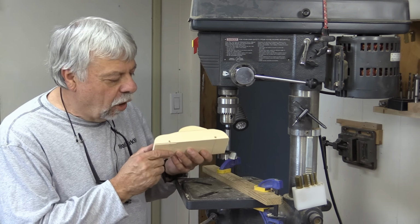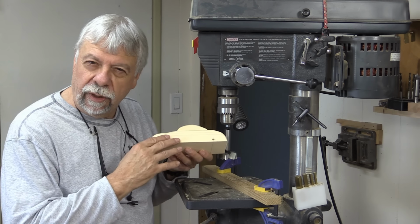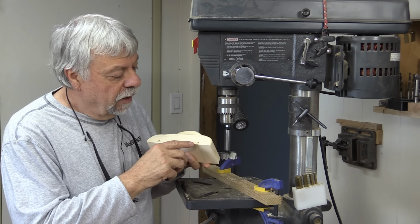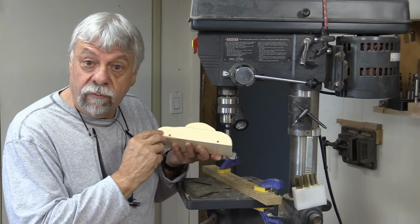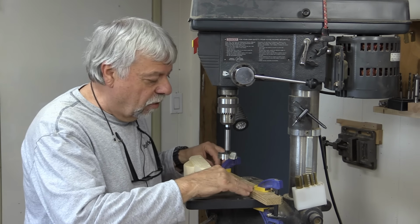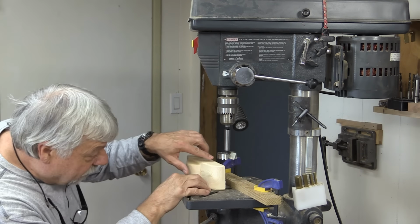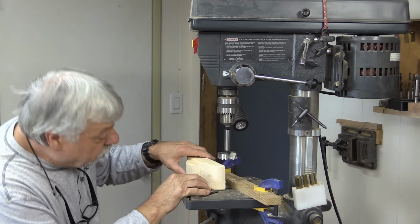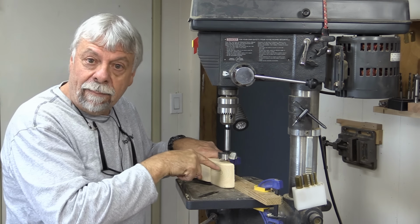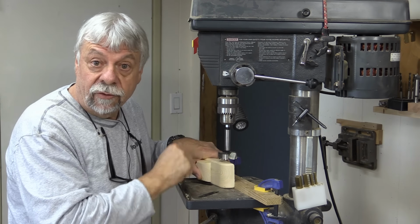There's our modified car, and in this one we're going to be cutting some holes out for the wheels to go in so they recess into the body of the car like a car does now. You can see that I've drilled the holes for the axles, and I've taken some time to align a fence here on my drill press. In order to find out where the center is, I can see the tip on my Forstner bit, and I can just align it with that, and I've already set the depth gauge. All I need to do now is drill the 4 fender wells.